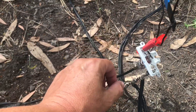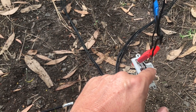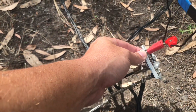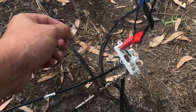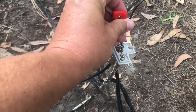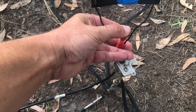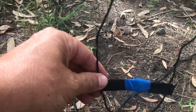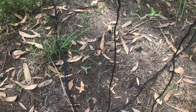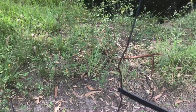The center core driver from the coax goes over to this banana lug over here. I've got the 20-meter element which piggybacks into the 40-meter element, and that's held apart by about 10 centimeters through some plastic spacers that are distanced about just short of a meter apart.